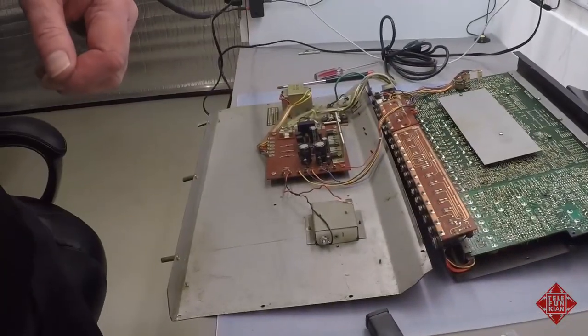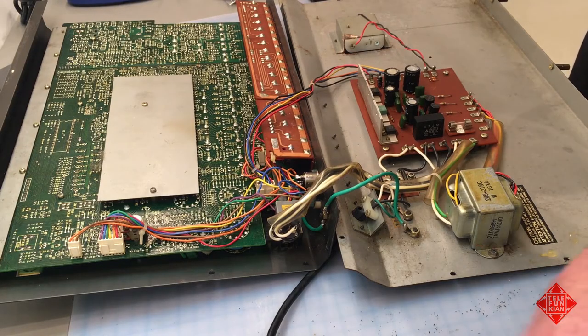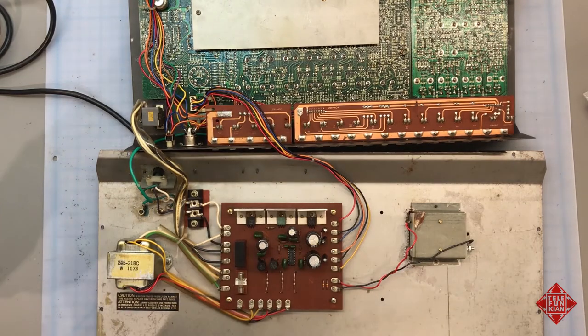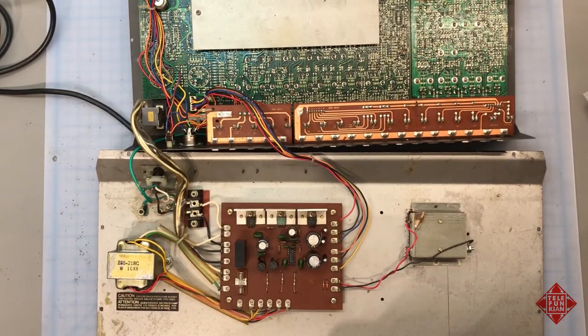What this is doing is reducing the potential for me to knock out one of the integrated circuits through unintentional electrostatic discharge. CMOS circuits are exquisitely sensitive to static electricity. In all my years working on this type of equipment, I have only once blown a CMOS chip by electrostatic discharge, and it just happens that incident occurred when I was working on an 808. So a word of caution: invest in a wrist strap to ensure any static electricity built up in your body is dissipated to ground.